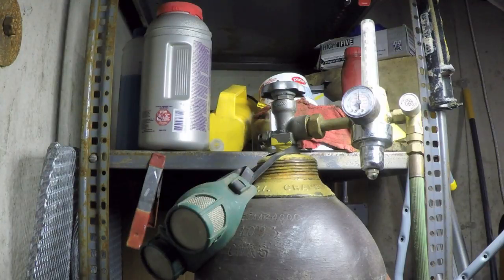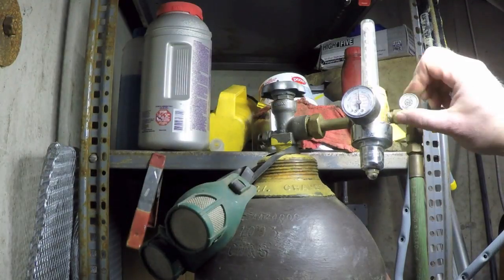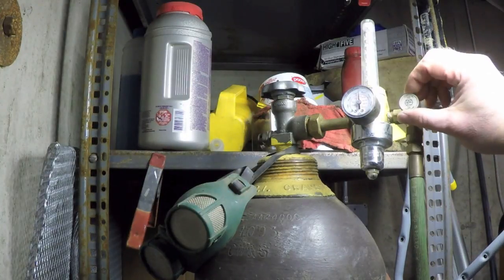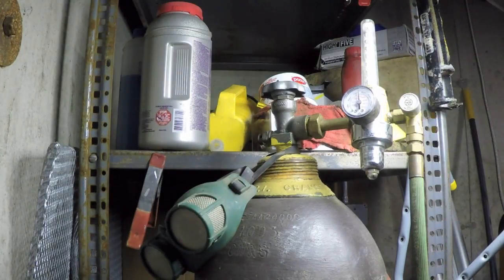Now I'm going to fire up the welder, and when I step on the pedal, the contactor should close and I should get flow. Then when I release the pedal and the contactor opens, flow should continue for the post-flow period. I've got my torch draped over my foldable welding table, not in contact with any metal, so I should be safe from drawing any arcs. I've also got the high frequency off for the moment. That was weird. When I turned the welder on, I heard gas flow, but it stopped. The ball's not moving. All right, let's see what happens when I step on the pedal.